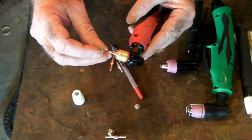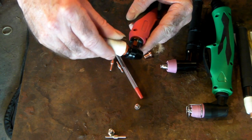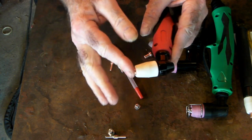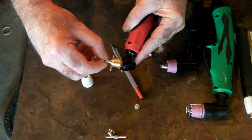For the short tips: put the shorter electrode in, put your swirl ring over the top, make sure you're using a short cap with a short electrode, then screw the whole lot back together. It fits perfectly. You end up with a shorter version of the torch assembly. You can also get the shorter electrodes in nickel-plated versions as well.